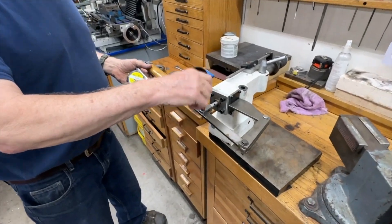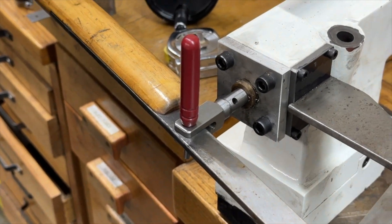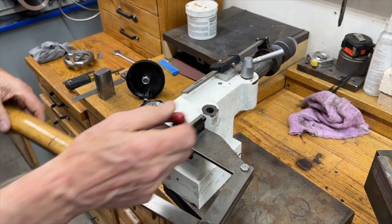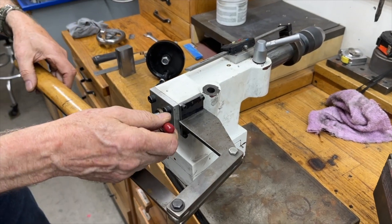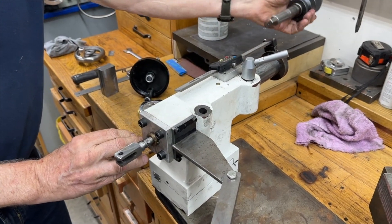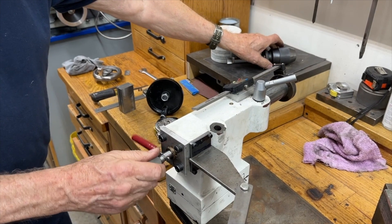You're probably wondering what this pin is doing in here. To eject the chuck or the live center you have to turn the tailstock backwards, so I have this pin that just drops in there and fits in a hole. I can run this backwards and eject the chuck because that's a left-handed thread on the other end of this.